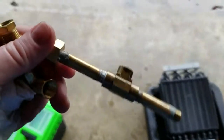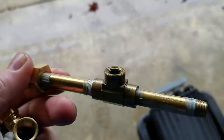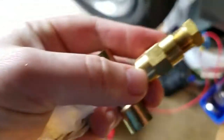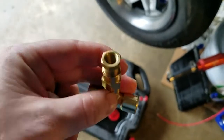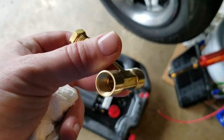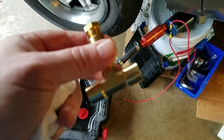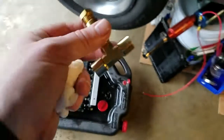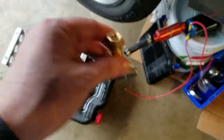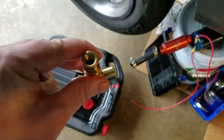One of the first things I've done is I changed this fitting — I was running the entire system through a little 1/8 MPT fitting to read pressure, and I changed it over to a quarter. It should at least have a reasonable ID on it so as not to restrict flow coming straight out of the pump. I'll be taking my pressure reading from there, and the first thing I'm going to do is a control test — just hook this up to the pump and dump it straight into a can and see if it builds any pressure.